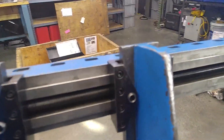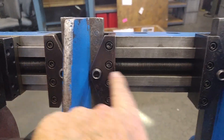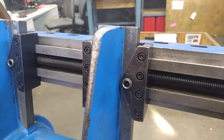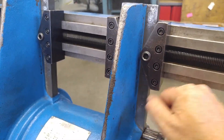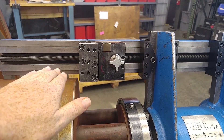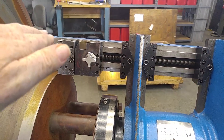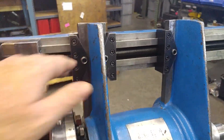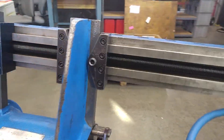When servicing the machine, you'll see these little cup marks on the back of the slide arm — that is from the locking screws. These are cup point screws and they're intended to dig in so that the arm doesn't fly off while it's rotating. However, those cup point screws not only leave a groove or a little ring, they'll leave a high point. You've got to get these covers off and lay a file or a stone on top of all four of these surfaces to get those high points off. The reason is that when the operator has a dial indicator and is trying to level the turning arm into position, if those screws drop into one of those divots, it's going to affect the arm — it'll want to self-center and find the path of least resistance. So get these covers off, file down these plates smooth, and we're good to go.